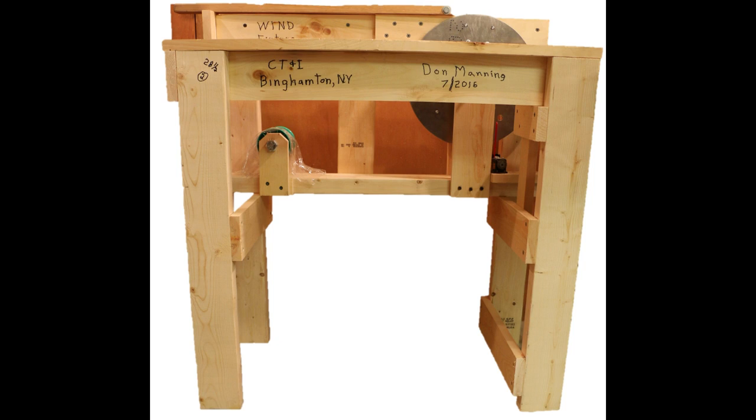Roughly 4,000 feet of it or something, which is a lot of it anyway. So that's the one we started to work with because we had very little 3/1000th diameter wire. As it turns out, the band that we built used the 4/1000th wire. On straight tension, the 4/1000th wire is stronger.